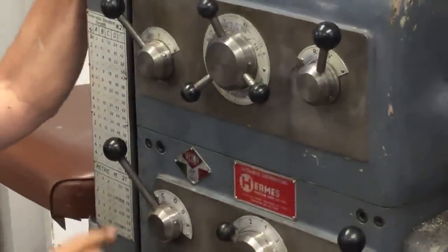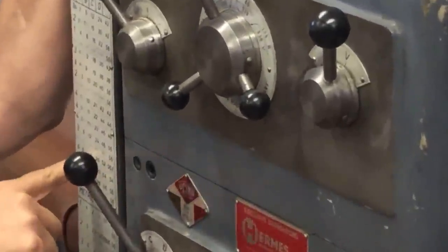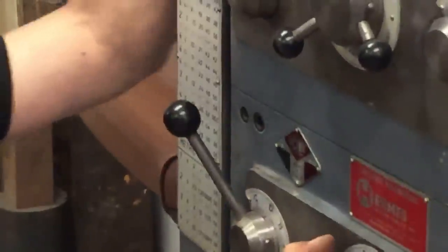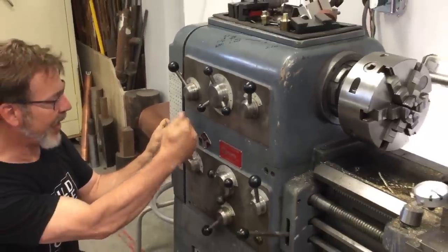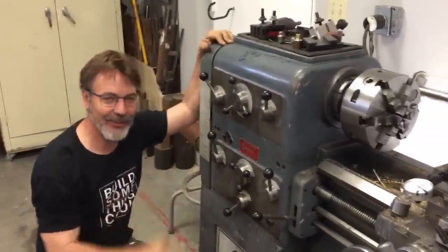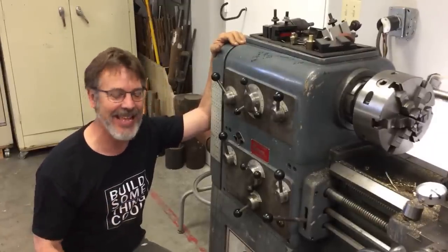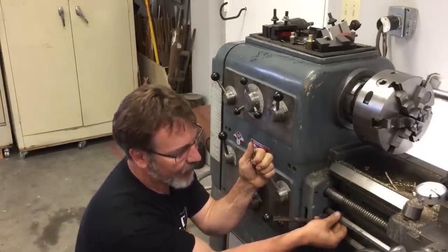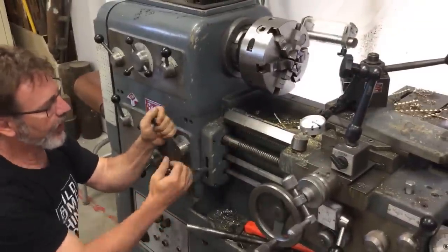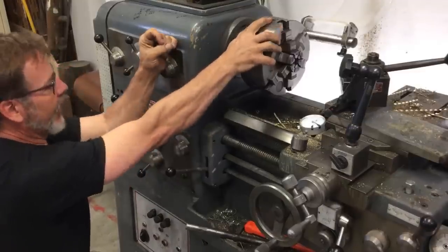But here's what's really screwy. I have this one that's a 56E. There is no such thing as a 56E change gear. But it's really important because if I set this to number 4, set it to A, to B, I get 13 threads per inch, which of course is half-inch thread, something you need a lot. I'm trying to figure out what is a 56E. Well, when you come over here to this lever, this changes the rotation of the lead screw, but there's an additional, of course it's not going to cooperate right now.